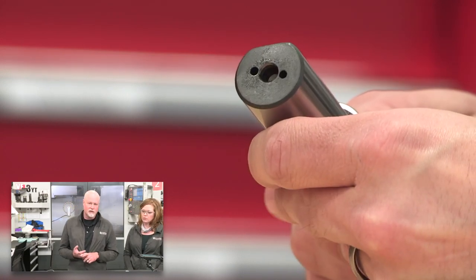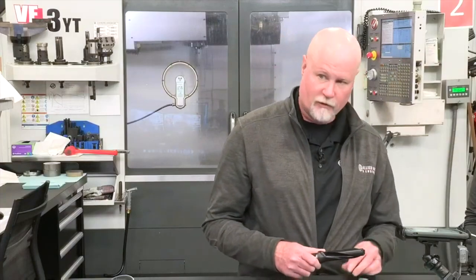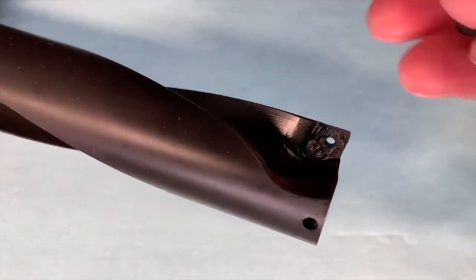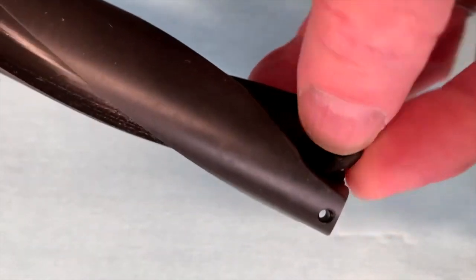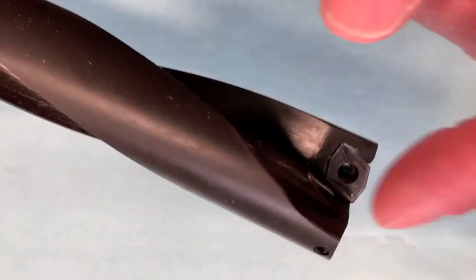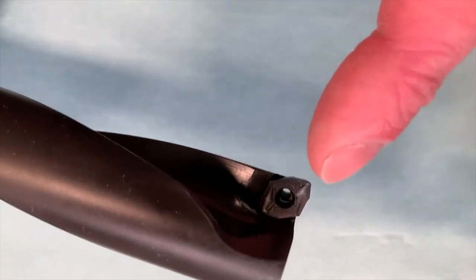The lengths available are 2, 3, and 4 times D, going from 12 to 47 millimeters. This 26 millimeter tool has two IC pockets but uses the same insert for both. One orientation is for the OD or major diameter of the cut, and when cutting on center the insert lays flat — so I actually get four sides off that same insert. We have five different geometries available for your specific cutting application.